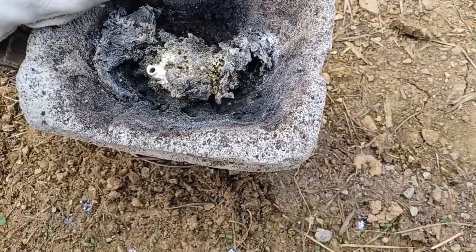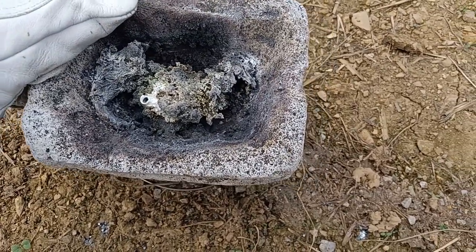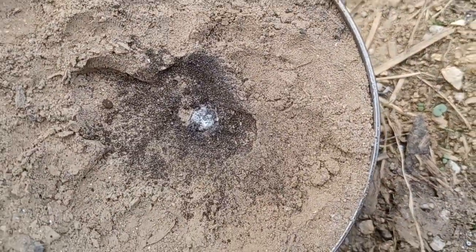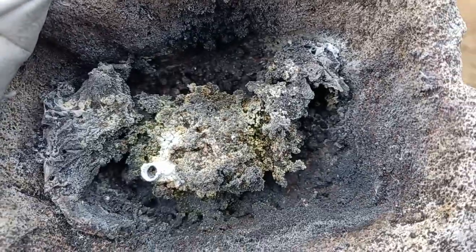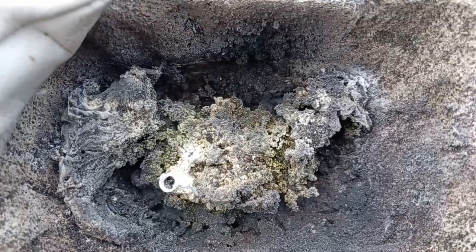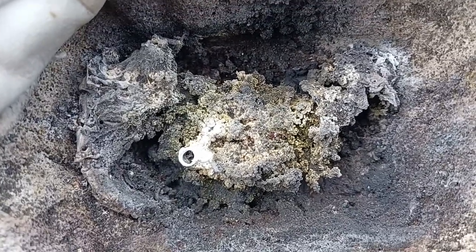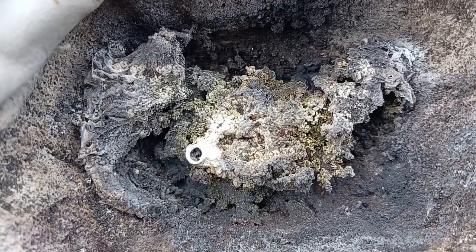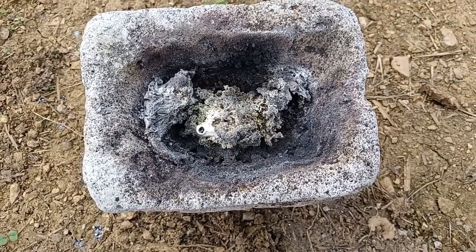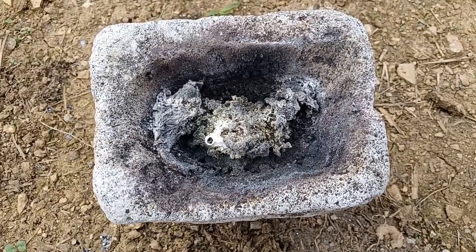The thing is still hot but I can handle it with gloves, so let's see if any of the metal actually flew into the mold. An itty-bitty bit of metal alloy actually got through. The rest stayed in the brick. I'll wait for it to fully cool down and then chisel it out to at least weigh it — to see if I got all 90 grams of alloy, or if there's still some unreacted copper oxide. You could say this somewhat worked — I still need to optimize it a lot, but it's a start.